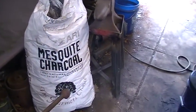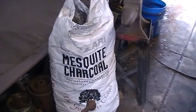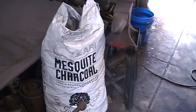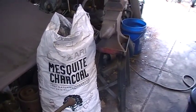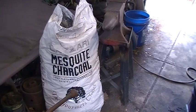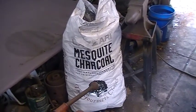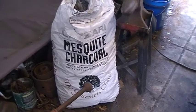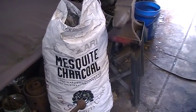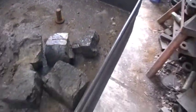If you have larger coal and want to get started, you can use mesquite charcoal to light it. I tried it out — it's way too flary, sparks and ashes fly everywhere, it's dirty. But it will light your fire: just put a little bit in, add some paper, and it'll light any coal or coke. I can get this mesquite charcoal for about $13 for a 40-pound bag. Too bad that's not what I can use, but the other coal is only about $25 for a 20–25 pound box.